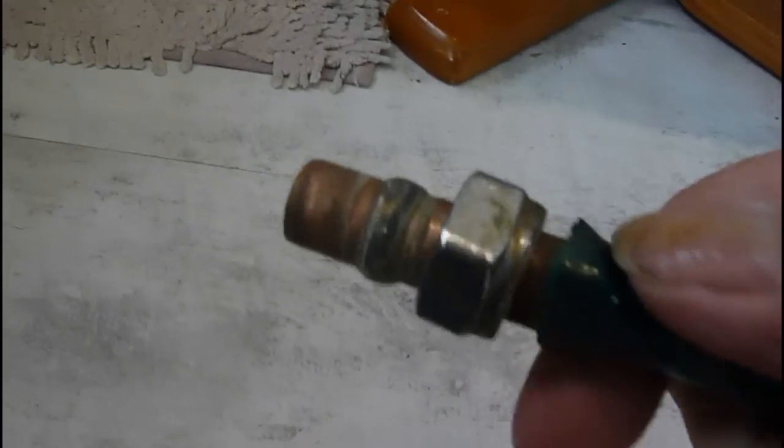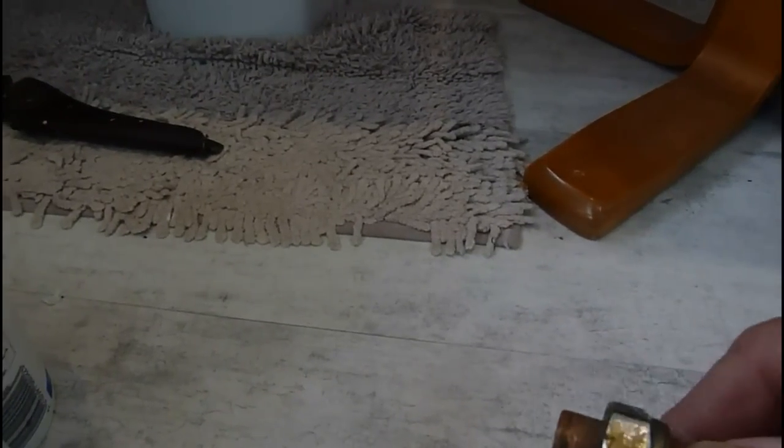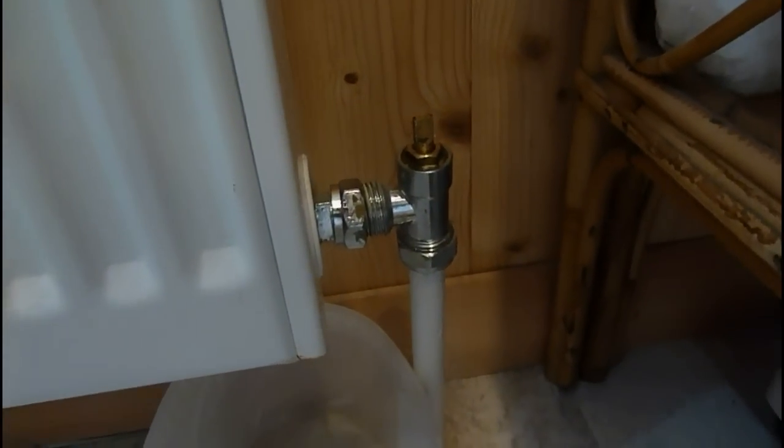Now the king piece - if you can find a piece of copper tube like this and wedge it in the hose pipe like a nut and olive. This nut and olive is going to do up on the end of that radiator. If you've got an old bit or you can find someone with a bit of copper tube with a nut and olive like that - you can even buy a short bit of copper tube and a coupling and just use the nut and olive of the coupling - screw it up on that rad valve. Once it's on, open the radiator valve and drain all the water down this hose and outside. Once it starts to run, let it go till it stops, then go upstairs and open all the radiator air cocks so air goes in and allows all the radiators to empty.